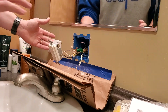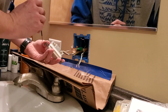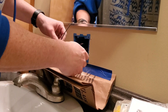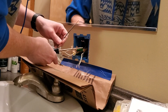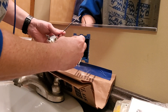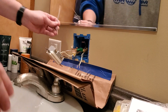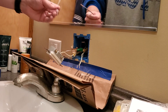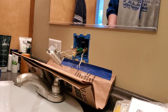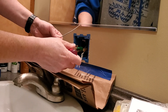My load side has the same type of screws — I've got a hot side. Which side is that supposed to go on again? The gold — good. The problem is this wire is a little bit longer than I like because if I put this in there's still a little bit of copper sticking out. I don't want any copper sticking out, so I'm going to trim it just a bit — we're talking an eighth of an inch. This is my house so I'm going to be nitpicky, especially when it comes to electrical.